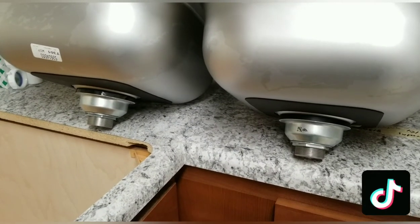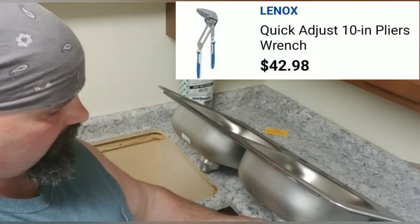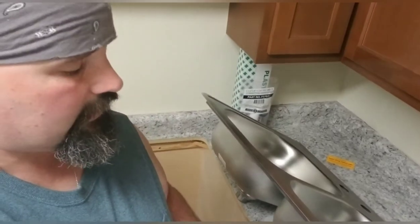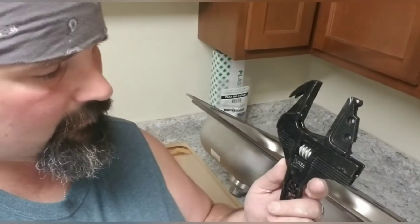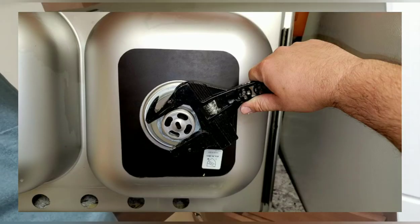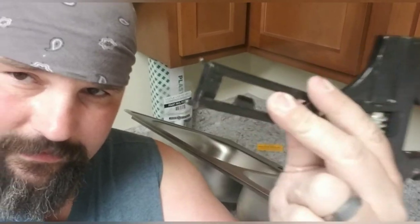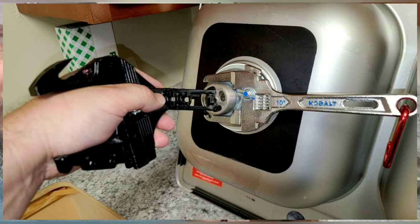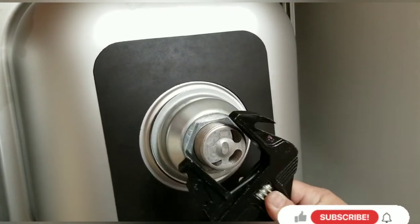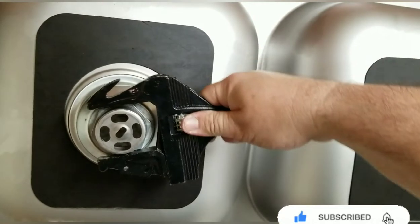To tighten up the strainers, you're going to need a pair of pliers on that lock nut and the special wrench to hold the strainer in place. I've got a multi-tool that was sent to me — the jaws are definitely big enough to fit around that lock nut. Since I need to hold that strainer basket in place, I'll use this tool's two little nubs on the bottom while I tighten up the other end with a vice grip. I'll go ahead and snug it up with an adjustable wrench, just getting it where I need it before giving it the final torque.